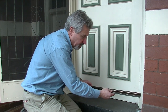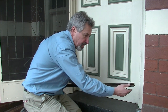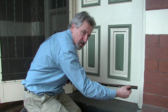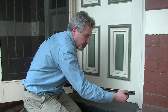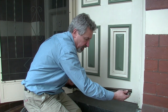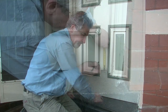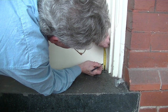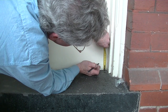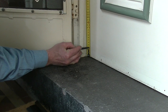The reason for that slight difference is so it's tilted ever so slightly. It's pushed down from the latch side and there is a little bit of twist available on this device, so having it down a little bit on the hinge side means that when it's driven down it comes down beautifully and straight on the doorstep. So the latch side is 40 millimetres and the hinge side is 38 millimetres.